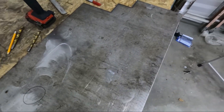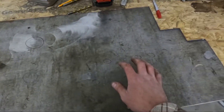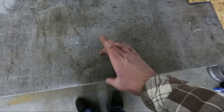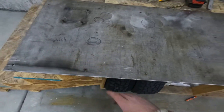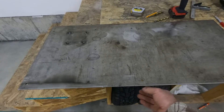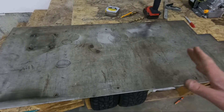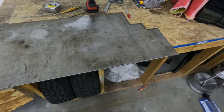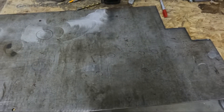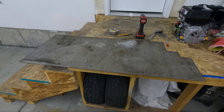I've laid out all my marks on here. This is where the pump's gonna go, engine will go here. I've set it back quite a ways because I'm gonna take this and go find somebody with a press brake to fold a flange here - for two reasons: the pulley for the pump sits down below where it sits so it needs to be raised up a hair, and just to give this more rigidity so it won't want to bend when I tension the belt. I'll get these drilled and slot these holes and we'll go from there.